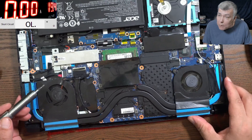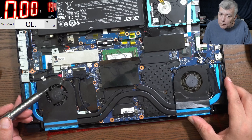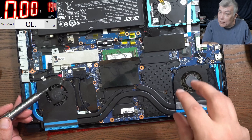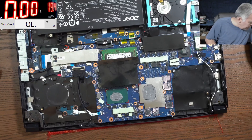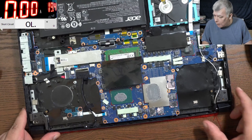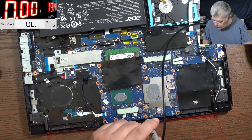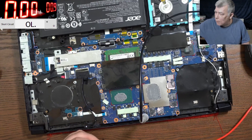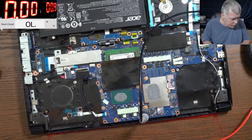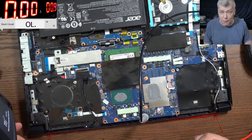If the GPU MOSFET is gone, then we are removing the MOSFET. The laptop should still work with the integrated graphics in the Intel. Okay, so the heatsink is out. Let me grab the power supply. Let's push some current. We use low voltage, obviously — like 0.9. That's a decent amount of voltage, just to stay in the safe zone.